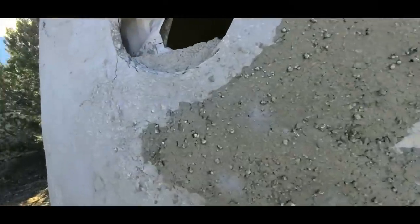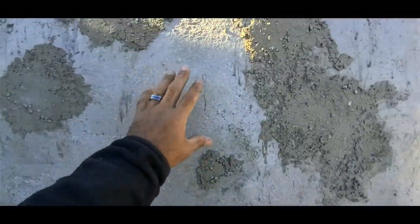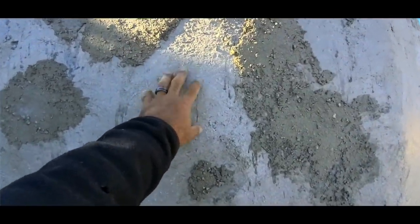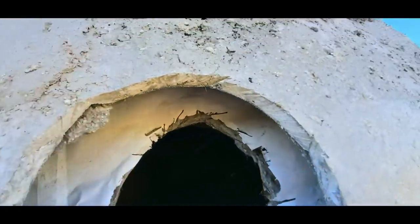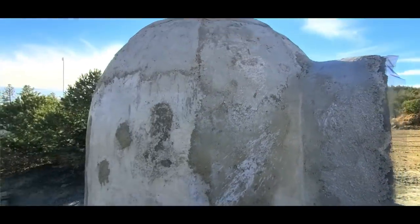Once the outside is complete, we're going to have a stucco coating over all of this — white portland cement with a cement dye to give it color, then smoothed out. Just to demonstrate how the dome was made with aircrete and cement: once you make your air forms, which takes about one to two days, you can have your structure up in no time for very little money. It's fireproof and insulated with six inches of aircrete.